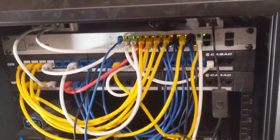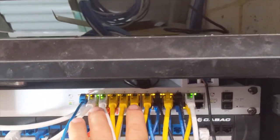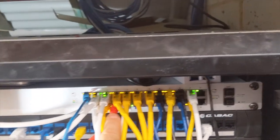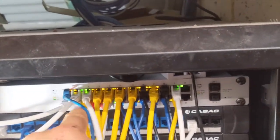I've got a UniFi switch — a PoE switch, 250 watt — and that's what I'm running the nanobeams on. The nanobeams run on a 24 volt passive power over ethernet. Although it doesn't really matter if you've got a UniFi switch, because you can select passive or 802.3 standard power over ethernet. Here's my comms rack. I've got my router up there and I've just terminated the cable coming from my nanobeam upstairs.